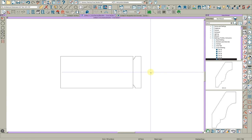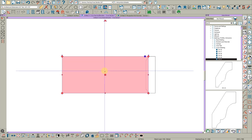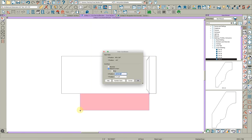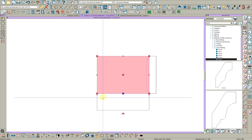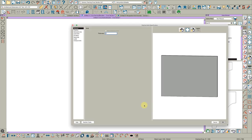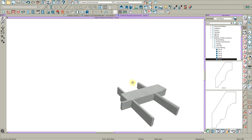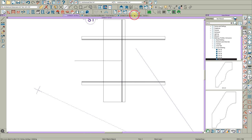Let's go to our cross-section camera here. I'll pull this polyline to here and go from there to the back — I'm using minus 22 on this polyline. I have a solid here; I'm going to make it 96 inches long. Let's look at it in 3D. I'm going to go to the floor plan view and center it on this line. Go to the overview.